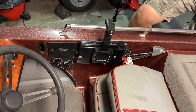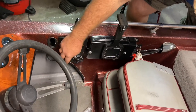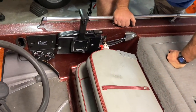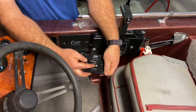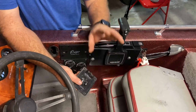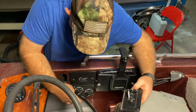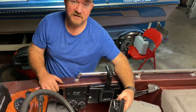Now I'll finish checking this — I'm going to stick plugs in the inlet of the drain and open the levers to the empty position, making sure we're holding water from the valve to the drain. To recap: this is the updated Flowrite controls along with the cables and three-position valves, so we've got the livewell system updated with recirculation, fill, and empty — the three positions. This is an upgrade from the original controls which just had levers through a cable to open and close the valve. Those parts were worn out and non-serviceable from Ranger. We put in the new control valve and I got the adapter plate from Ranger to fit the boat. I'm happy with the installation — see you next time.